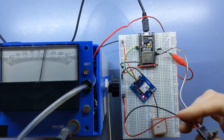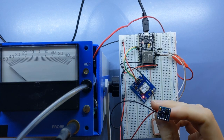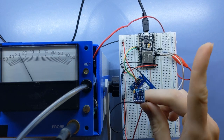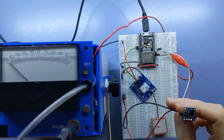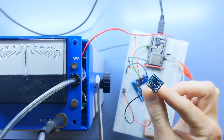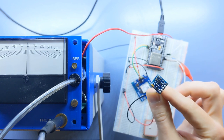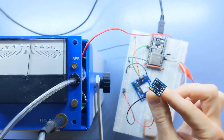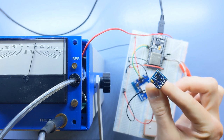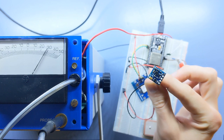Having added the magnetometer, it needs to be calibrated, otherwise its outputs would be unusable. I've made a 1-minute short on how to do it, a link here and in the video description. Our device can now use the magnetometer to measure its orientation in Earth's magnetic field. Still wanting to point the needle northeast, we can calculate the heading and have the needle point northeast wherever the device, or more accurately, the magnetometer is pointing, at least in theory.